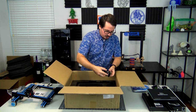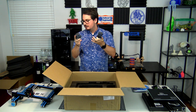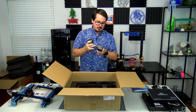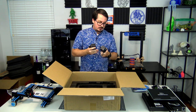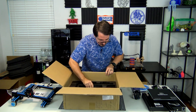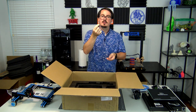And then we have the two extruders — these are the extruder motors and the extruder units themselves. There are two of them because you're feeding two different types of filament through. They get mounted on top of the Z-axis supports at the very top of the printer. The extruder itself looks very similar to the E3D Titan, which is a pretty popular open-source design. So I have a feeling this is going to work quite well. There were also just a handful of screws and a couple of wing nuts for the aluminum extrusions.